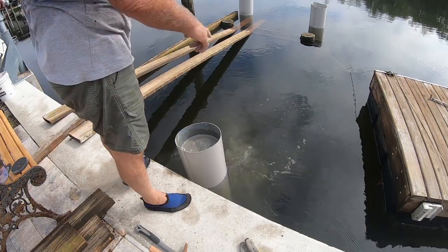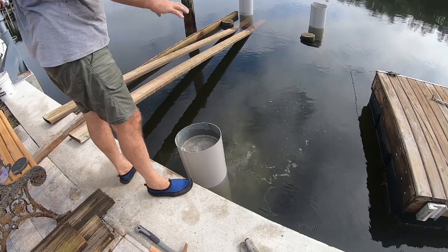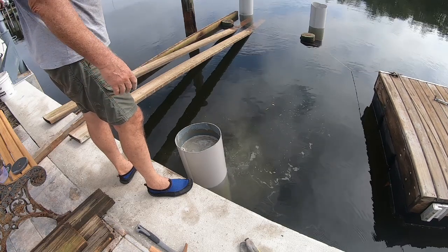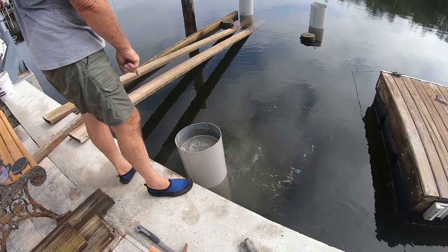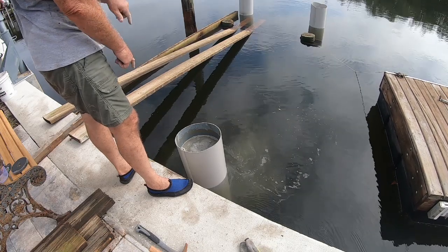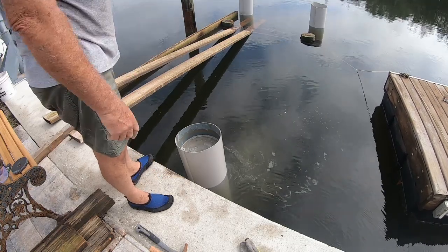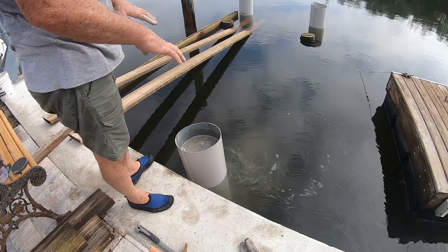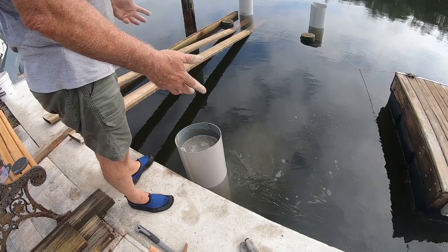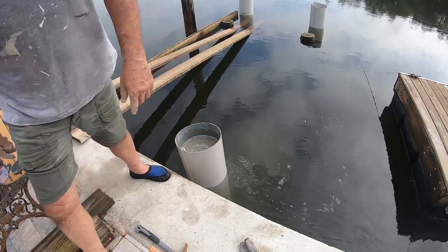There was a little plume of cement in the water. I imagine part of that is the overflow from the bag, but part of it is a little bit of leakage with the water mixed on the key that slides down the side. And there may be a little bit at the bottom too where it could escape somewhat, but basically the cement is heavier than water. It's a solid and it's displacing the water. So I'm going to put one more bag in there.